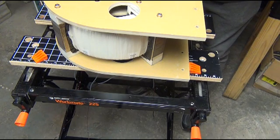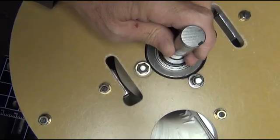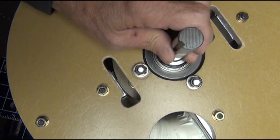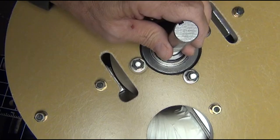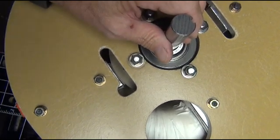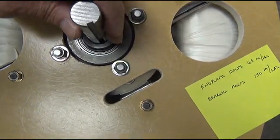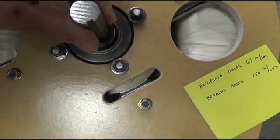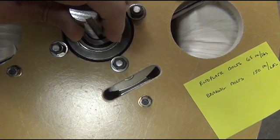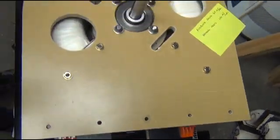Those are in place. Then we just remove the shims, checking the gap against all four pole pieces. It looks good here — there you can see the gap. Looks very consistent. Check here on the other side also — checking all four. It spins freely and it looks good. It's all assembled.